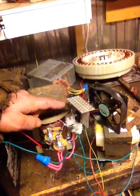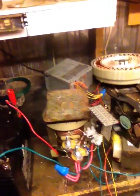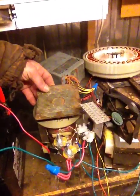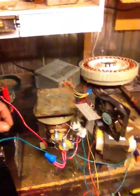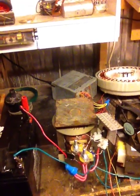It runs back through the 1K resistor, which allows the circuit to stay under about 12 volts negative as it pulls back through the system. So it doesn't blow up my MOSFET — because that was the problem I was having. It would load up, then the kickback would come and drive the voltage up to about 40 or 50 volts, which is too high for a MOSFET, and then it would kill it. I went through about 30 of them before I figured out how to do it right.